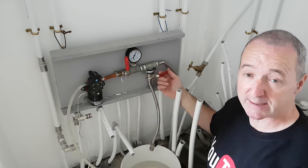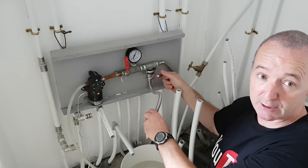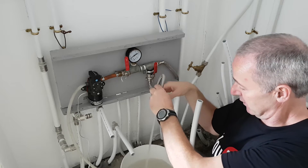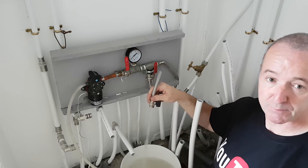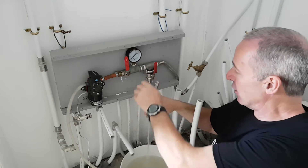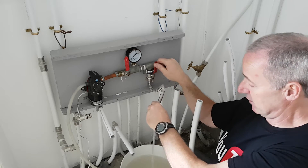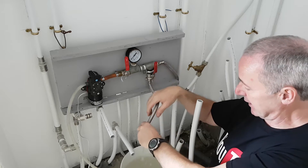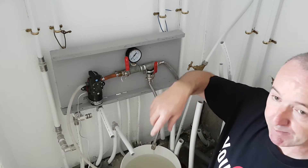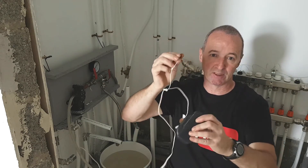What I'm going to do now is drain the system. This is the bypass valve, and when I open this the water will come out — I'm just going to hold it because it will be under pressure. Now it's water and air mixed. You can see the gauge drop to zero. It's got about a bar of pressure — about 14 psi — still in it. And that's it, it will be water and air mixed. Some of that got my leg.